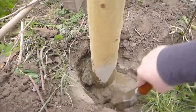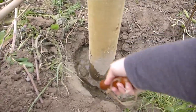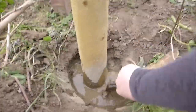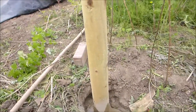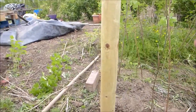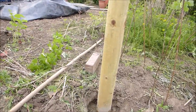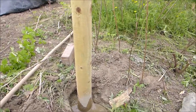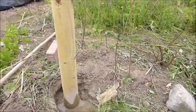By doing this in two stages — doing the bottom bit and mixing it, then doing the top layer — this will ensure that it has gone right down to the base and is secure. We are going to put the mesh fence on here so it's not going to have any wind barrier as such. The wind will travel through quite easily so there shouldn't be any resistance.